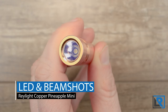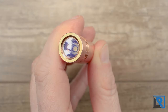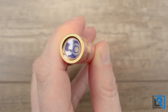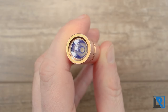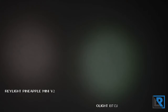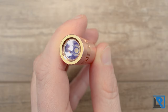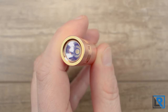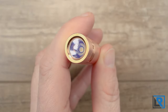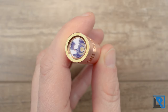The star of the show is really the LED being used — a Nichia 219B R9080 at 4500 Kelvin. It's a tint snob and high-CRI fanboy's dream LED. The R9080 batch number indicates the tint is a little bit rosy, almost pink, while maintaining a neutral white. Output isn't up to modern standards, but where it lacks there it really makes up for in quality. These LEDs are fairly difficult to get in any decent quantity as they're no longer produced. The CRI measures roughly at 97, which is fantastic.